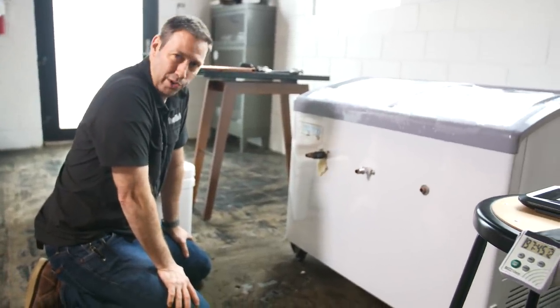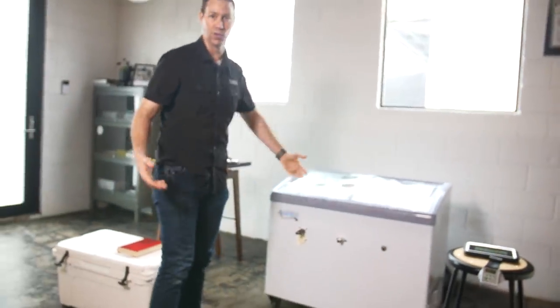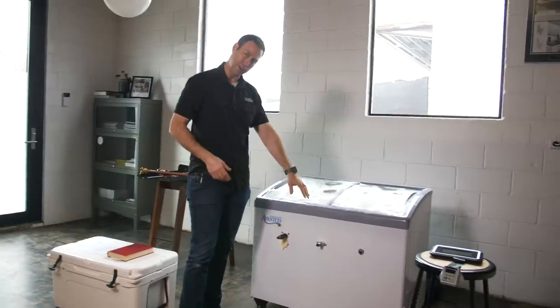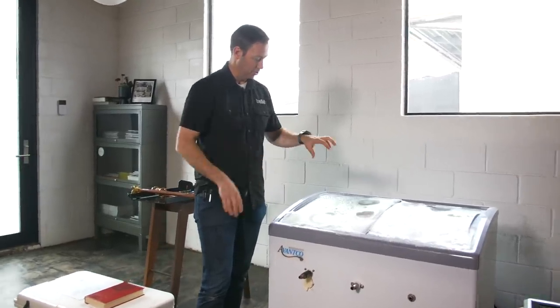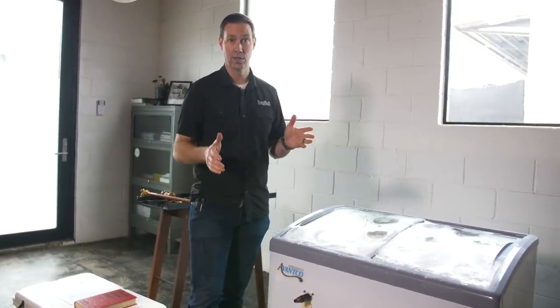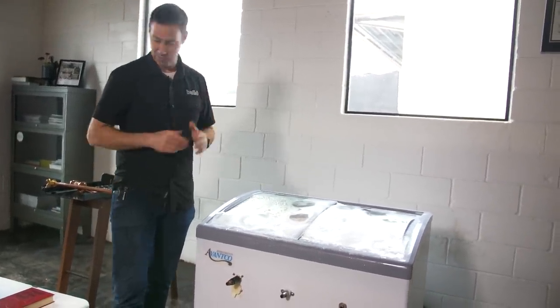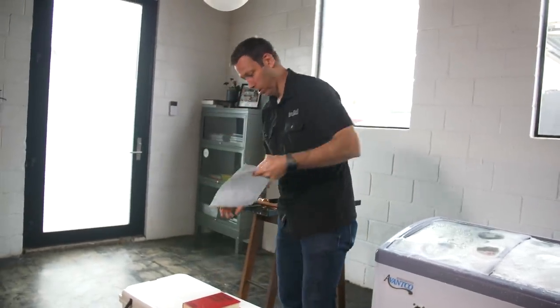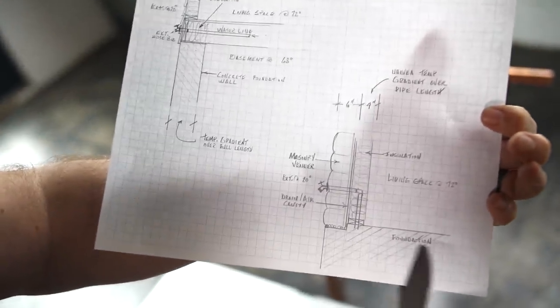The really interesting part of this test is I didn't expect so much condensation on the brass fixture. It makes me wonder about other climate zones — what is happening to brass fixtures behind the wall in Wisconsin and Vancouver and cold climates? Is this kind of condensation happening inside the wall cavity? This cooler only has about an inch and a half of insulation, so from minus 30°F inside to 70°F room temperature, that's a 100-degree delta happening in an inch and a half of space.